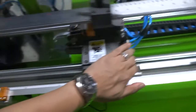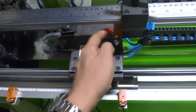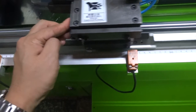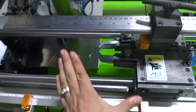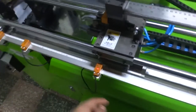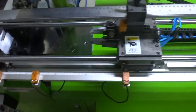This sensor controls the clip open time. Normally it should be at a similar position to what is shown. When the clip goes back, the sensor light comes on. There is a little bit of distance, and once the zipper passes this sensor, the clip will open and stop the zipper at this position. If you want the clip to open later, you can move the sensor to delay the clip opening. Normally it will be at a similar position.